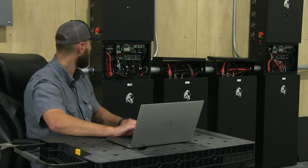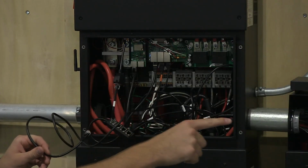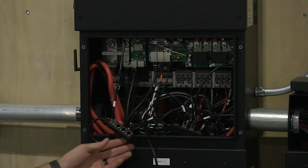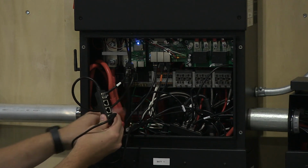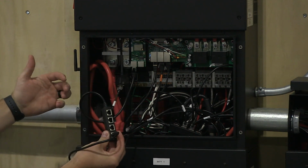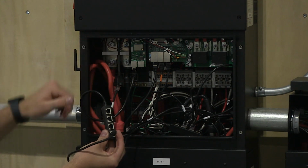So I'm now going to connect the child inverter first and then disconnect the parent inverter COM port. I'm now going to take the patch cable that I've previously run and connected to the child inverter COM port and connect it to the splitter from the WCM. I can now disconnect the parent inverter, and if you notice, power was never cut to the WCM.